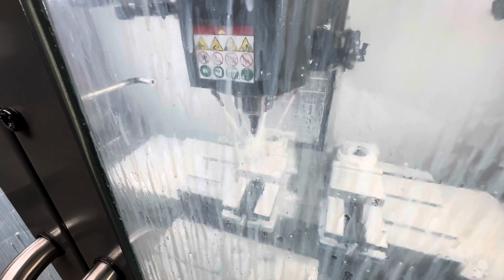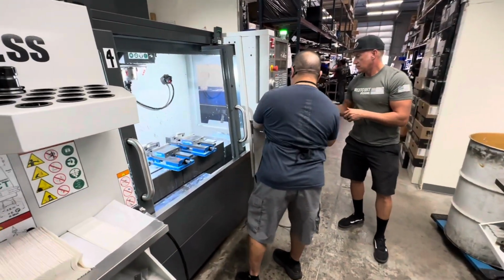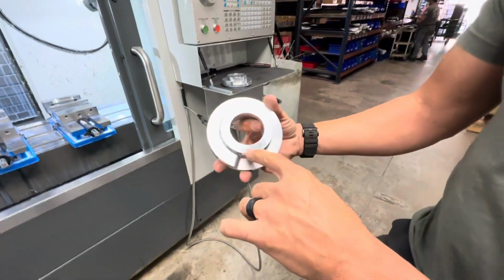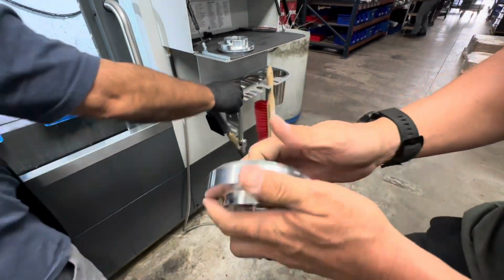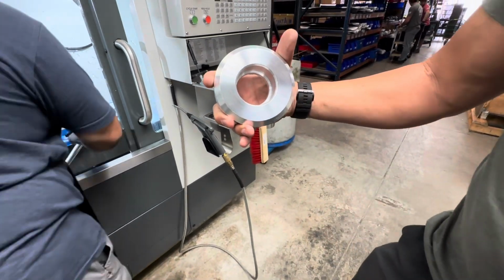All it is doing is lightly putting a nice surface on there, a nice machine finish, very lightly. That's the coolant that it's spraying down on there. This is a CNC mill, the other one was a lathe. And all of our parts now have the part numbers up here at the top so we can distinguish the difference on all these. But you can see the nice machine finish here, the surface here, and then how it's machined out here to fit the different types of shock bodies.